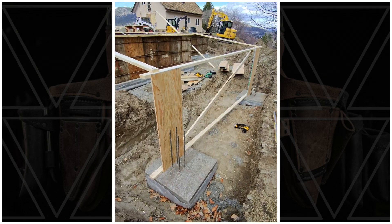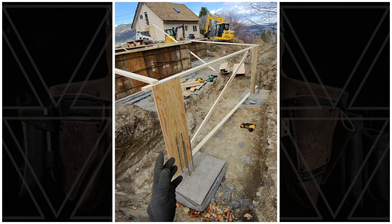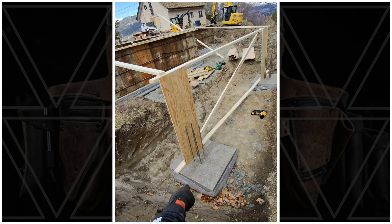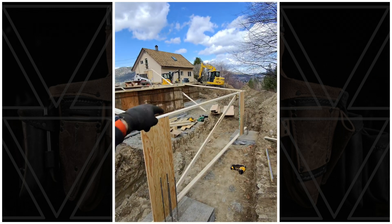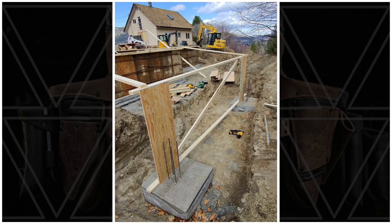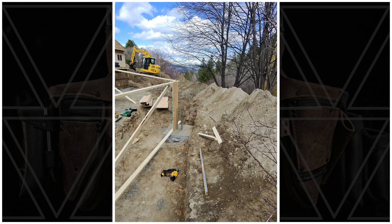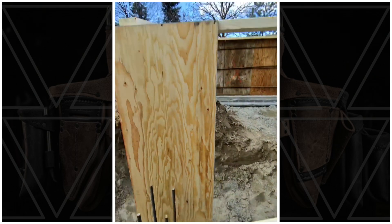Here's how I quickly build columns accurately and strong: these go-form panels basically build like a wall. You do a bottom plate, top plate, put those two panels on there — top plate is on matched layout to match the bottom — put a sway brace on it that levels both the panel side to side, and then brace it back to the building or stakes. Those three braces take care of the entire thing. I've got some bulkheads over there to nail in and we put in ties, and it builds quick. Super strong, not annoying and slow like traditional strong backs and whalers — quick and easy.